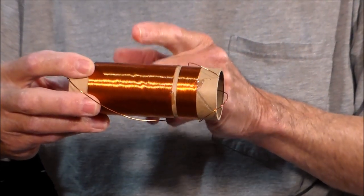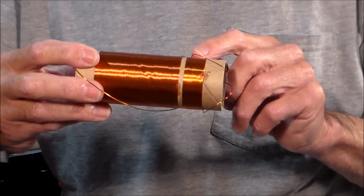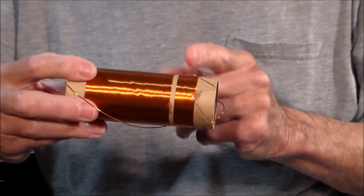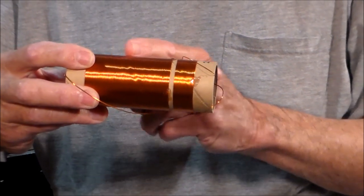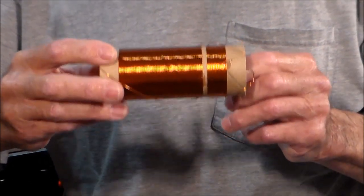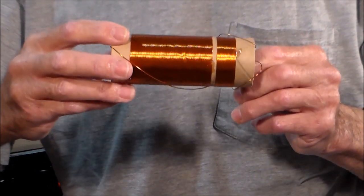There is no direct connection between the tuning coil and the antenna coil. The antenna coil is connected between your antenna and your ground — it is part of the antenna ground system. When radio waves strike your antenna, they set up a minute alternating current in the antenna ground system, which includes the small coil. The small coil sets up a minute magnetic field that cuts across some of the turns of the large tuning coil, inducing a very small alternating current in it. This way, your radio gets the radio signal but does not have to contend with all the resistance present in your antenna ground system, which makes tuning much, much sharper.